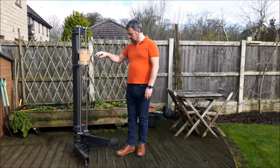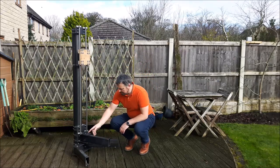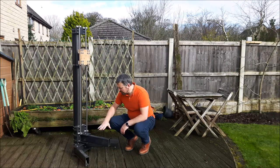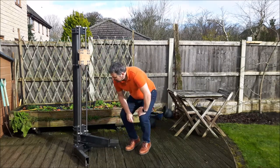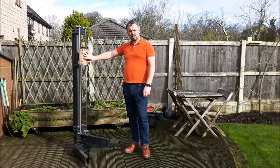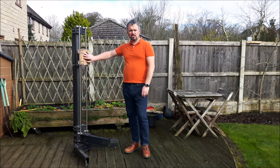I need to do quite a lot of fettling to get this running better. I also need to start thinking about the next difficult thing, which is putting the triangular plate on here and fixing that down with the ball joint — and the second plate that's like the swash — then mounting some bearings so I can get a platter on here. Once I've got that, I need to think about the radius axis. This MDF piece is just on there to help with prototyping, to figure out what I'm going to do before I start machining more expensive bits of aluminium, which I think is what I'm going to use here just to keep the weight down a little bit.